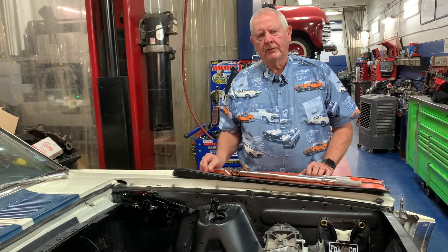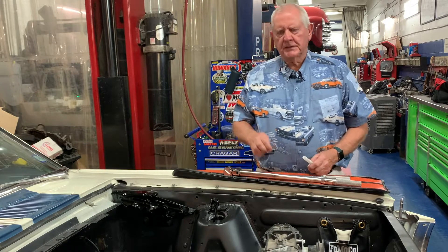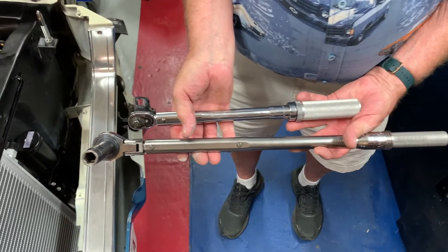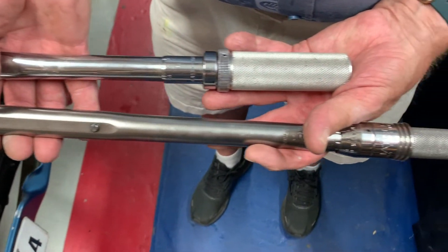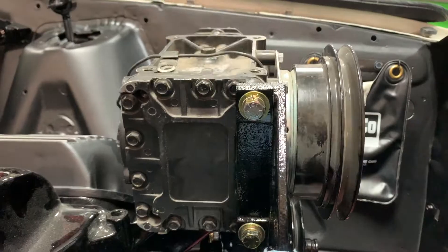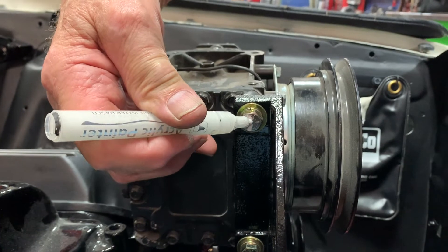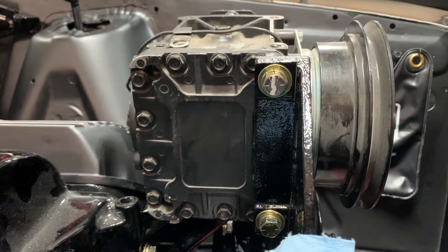So we have a method here that we've found helps us make sure that all the bolts are correctly tightened. That method is that you take this bolt and use a torque wrench like this and tighten it down to the proper specifications. And once you get it there, then you take an ink pen — this acrylic ink pen — and mark the end of it like that, so that you know that this bolt has now been tightened.